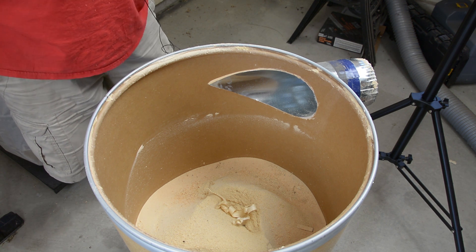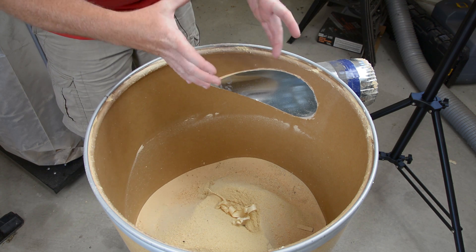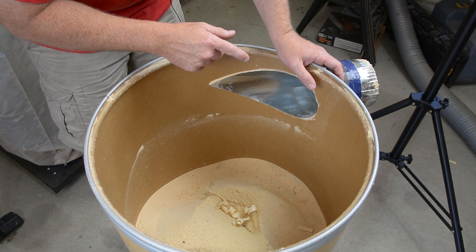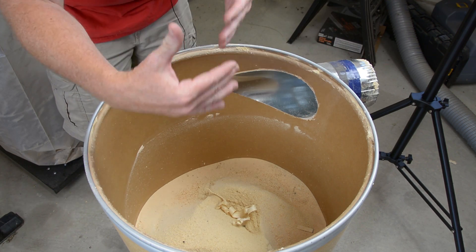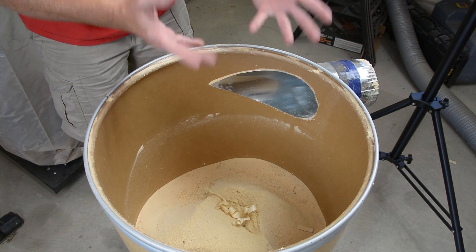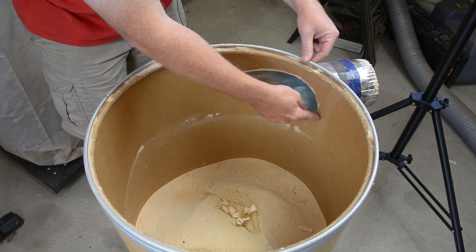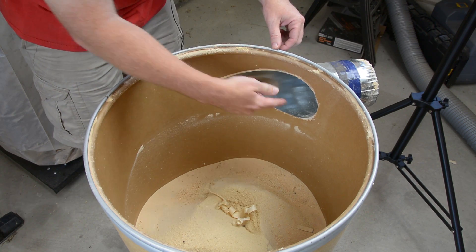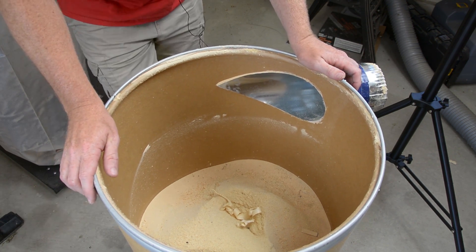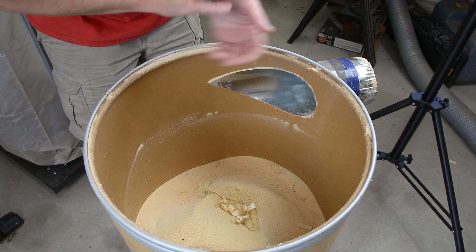While I have the camera set up like this, I want to show you how I did the inlet. This is a piece of five-inch hard steel ducting like would be used in an air conditioning system. I found online a calculator that will generate paper templates for when you want to have one pipe intersect another pipe, and that's essentially what this barrel is — it's a big pipe with a little pipe coming in at some angle. I wanted it tangent to the side at 90 degrees, and what it does is print out paper templates. One you paste onto the big pipe and it gives you a teardrop shape to cut out. Fiber barrels are really easy to cut — a jigsaw with a fine-tooth blade or even just a good sharp razor knife.